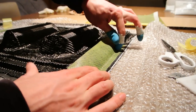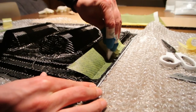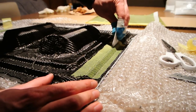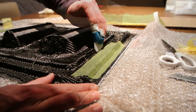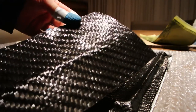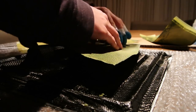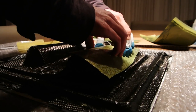Here I'm backing those tight edges with some 200s — this is only for the edges, just to make sure they are strong enough to withstand the pressure for the vacuum bag. This is how I work: lay it down with the backing film on it, then remove the backing film for a tight fit onto the mold. This is a 400s going all around the mold now, fitting all the edges of the entire mold.